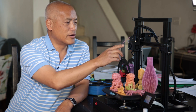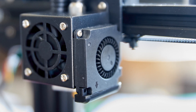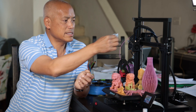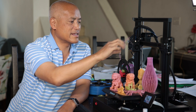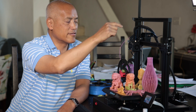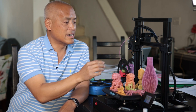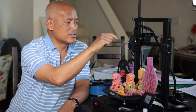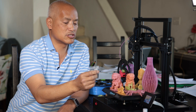It has a Bowden extruder and nozzle with a cooling fan and a part cooling fan with a little shroud underneath to blow air to the nozzle. It does have a little PTFE tube between the nozzle and the coupler. I had some issues with that trying to get the filament to feed properly, so I ended up removing the PTFE tube and feeding the Bowden tube all the way through down to the nozzle, making sure to get a really tight seal. Otherwise you'll get clogging and oozing, so make sure that tube is tight all the way down.